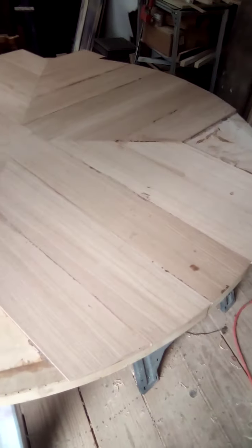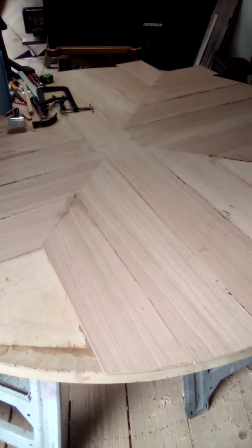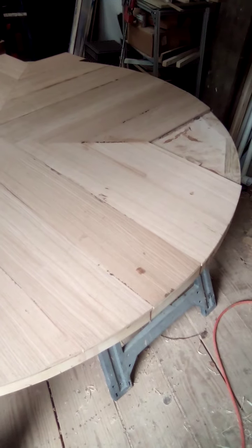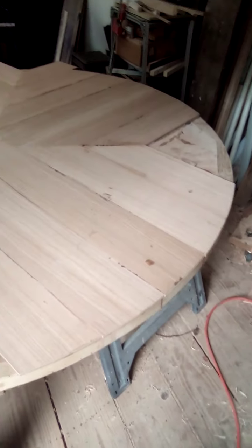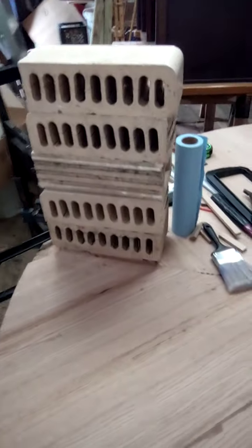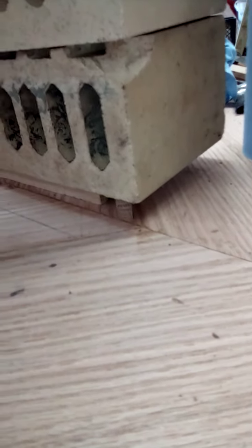I've done a couple of other videos showing in some detail how these veneered panels are made — if you don't know what I'm talking about just put a message in the comments. Right now I'm finishing up the corners on these sections, and I've got the last little panel underway with my sophisticated clamping system — blocks sitting on top of some cauls right down in the corner to get that joint nice and firm.